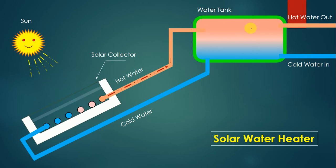As the lighter hot water moves upward, it is deposited in the water tank. The upper part of the tank is occupied by hot water and the lower part by cold water coming from the outside pipeline. Cold water has higher density and hot water has less density, which is why hot water stays on the upper side. As hot water enters the tank, the tank volume is constant, so cold water is pushed out and flows into the solar collector.